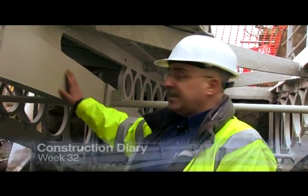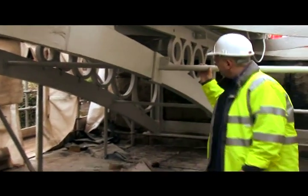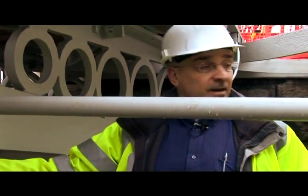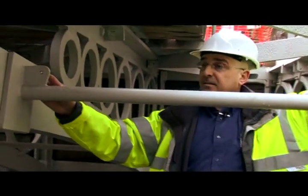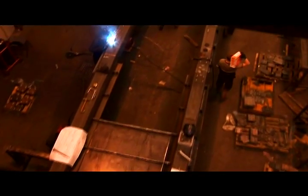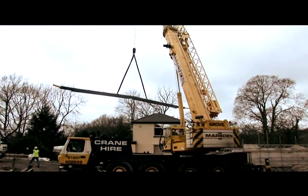What they've done is bonded extra steel plates to the rib to thicken it up and make it stronger. These bracing beams were originally just very thin tie rods, so they've replaced those with new much stronger reinforced bars. Later there'll be diagonal ties between sections just to brace it all up and stop it flexing. Preserving the structural integrity of the bridge had always been a priority. Because of the bridge's weakened load-bearing capacity, it would have been easy to replace the Bailey Bridge with another similar solution. Engineer Steve explains how the new structural additions ensure safety whilst allowing the original bridge to carry the weight, making it more than just an attractive facade.